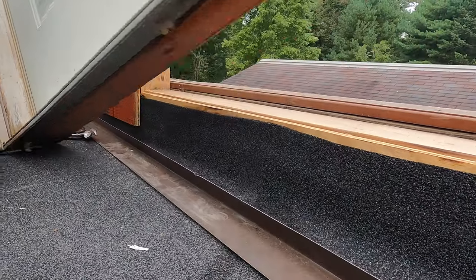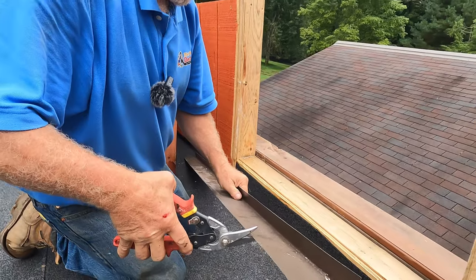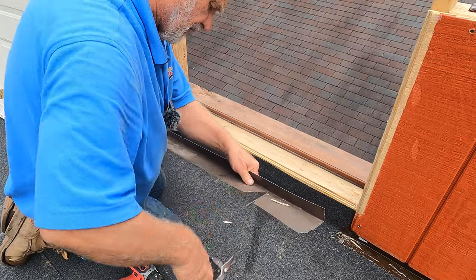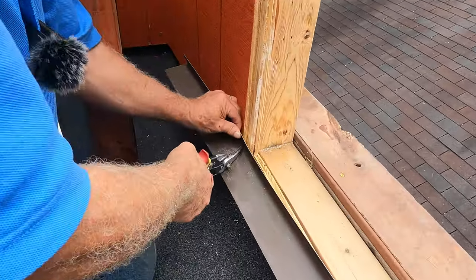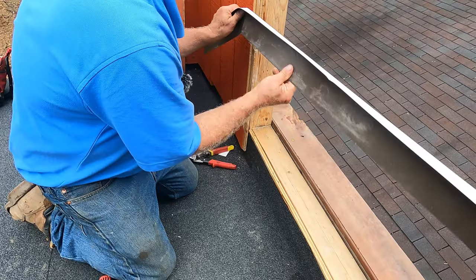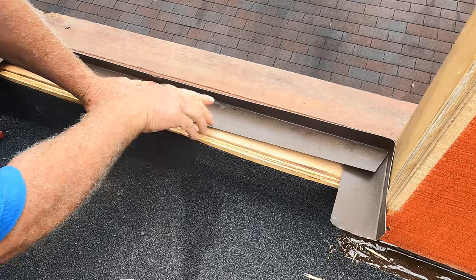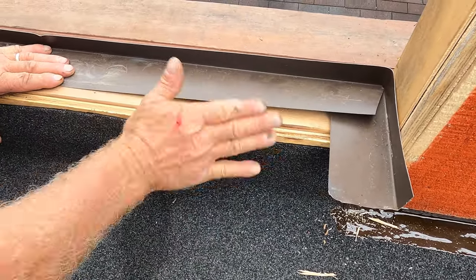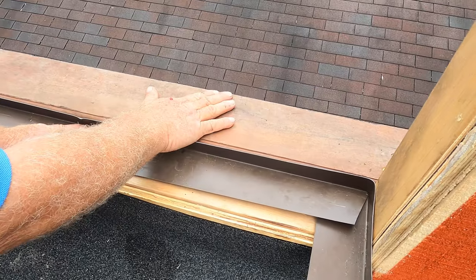You need to protect that part of the roof. In the old days, they used to make a pan out of copper — something like this. That would sit inside there, and then the copper would come over the top. When water comes in, it can flow out again. That was the idea in the old days. And this should not be higher than the floor, because you don't want to see it — this is the floor inside the house.